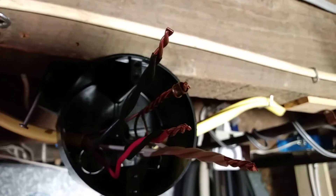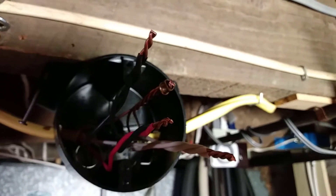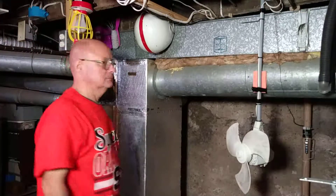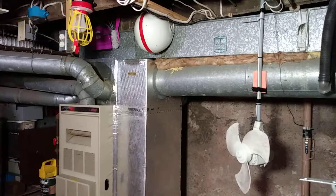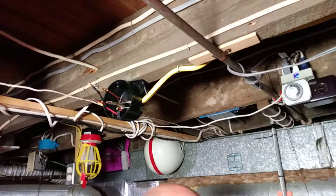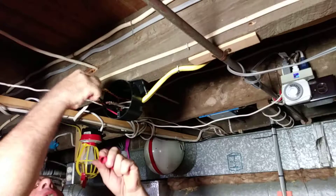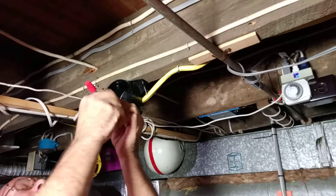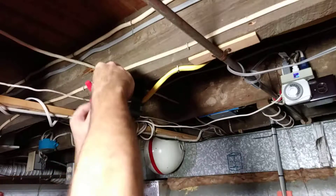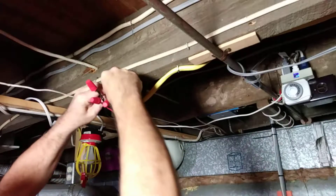You can see how the wires are twisted neatly together. When I strip my Romex, I bring the jackets into the box about a quarter of an inch. We've got to put the wire nuts back on — you can't fold live wires into a box. We'll push our ground wires back and make sure that this end here doesn't poke into anything.